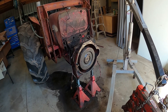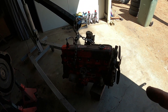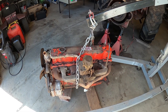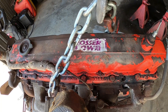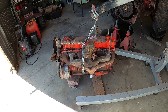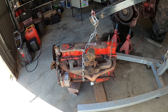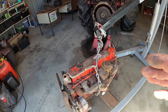Being a cast head, there isn't going to be any welding, especially inside the combustion chamber, so we've gone to Plan B. Here we have a Holden 186 engine that I bought from a guy down the road. This one has some interesting history - it's actually a local motor. Prosser Power, 20 years ago, used to be an engine reconditioner. The engine was reconditioned, put back in a vehicle, done about 70,000 ks, and then the vehicle was rear-ended and written off. So apparently it's a good running motor.